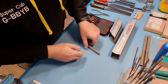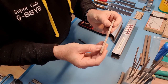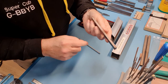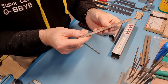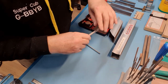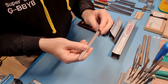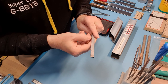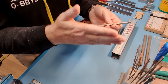Then there are these little beasties — really useful steel bars. This one is exactly a quarter-inch wide, and one surface — just the one — is coated in tungsten carbide, fine grade. What this allows you to do is cut perfect notches in bulkheads and ribs: the notch will be exactly a quarter-inch wide. There's also a smaller version that's one-eighth inch wide. The edges are really crisp and sharp, so filing down against something creates exactly the right-width notch — really useful.